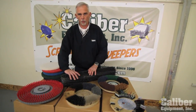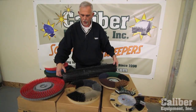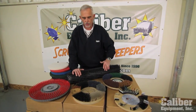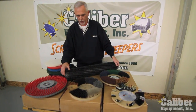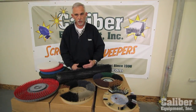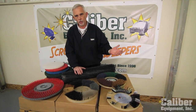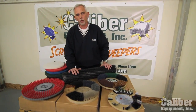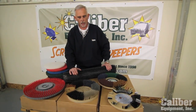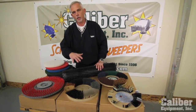There are some machines that you can get with roller brushes, also called cylindrical. All scrubbers come in one of two types: either they use disc or round brushes, or they use one or two roller or cylindrical brushes. You can get these in the same different types of bristles depending on your floor. Generally cylindrical machines have two of them and they're designed to sweep and scrub at the same time. There's two underneath the machine spinning at high RPM, and there's a little catch tray. So small debris that you didn't pre-sweep — or if you're trying to save labor — that's where cylindrical or roller brushes become an advantage, because you're letting the machine and the brushes do both jobs at the same time. It's important to pick out the right bristle and the right type of brush for the floor you're trying to clean.